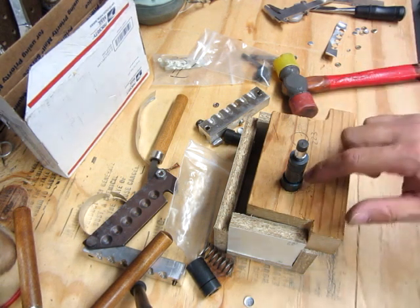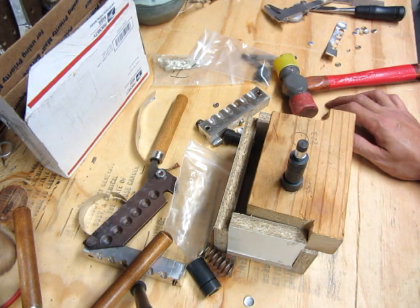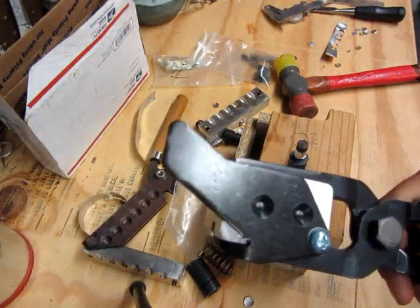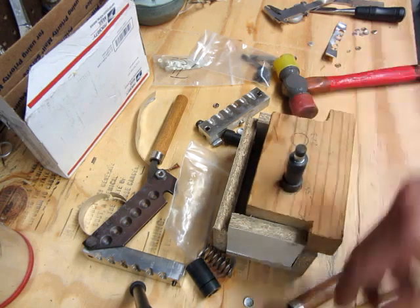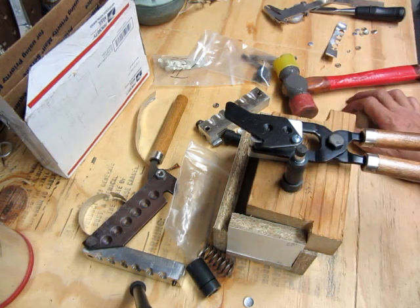I thought I'd just show that — it's a really nice system and I wanted to showcase it for the manufacturer. He's like a one-man band. Check him out at freechecks.net — I'll put the description below. If you're into reloading and want to save money from buying jacketed bullets from Midway or somebody, and you have casting equipment, a two-cavity Lee gas check bullet mold is about $26. The Free Chex tool I believe was $70. Commercial gas checks run about $30 to $40 for a thousand from Midway, so you have to crank out quite a few to make your money back.